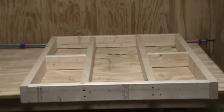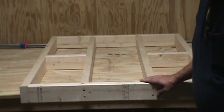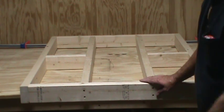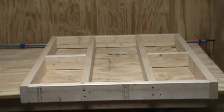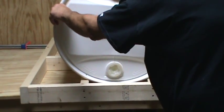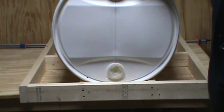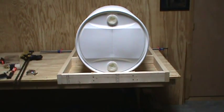This is the first shelf of a water storage shelf that I'm going to put up. It's going to be two tier. One barrel is set on this shelf and then I'll make another one just like it and I'll have a stack of two. It'll set just like that. The barrel sets up a half inch above the front 2x4 so that you have plenty of room for your valve and your piping work. And this should work out pretty good.